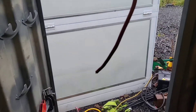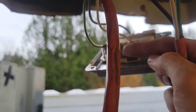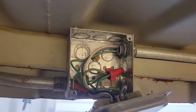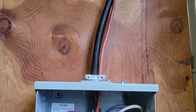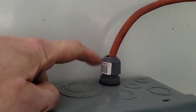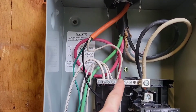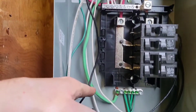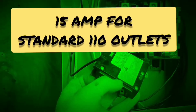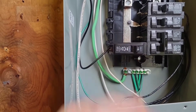From the scrap wire pile I grabbed some extension cord, shoved a piece up through the conduit, stripped the ends, and put them into the second screws on the outlet. Brought that cord right down and through the clamp ring. We ran the white to the whites, the green down to the greens, and the black goes to a breaker — hook to the side and push in.